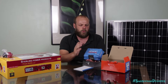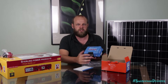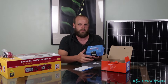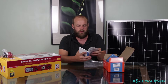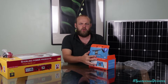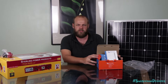There are many different brands online, and we'll put a link in the description to where we bought this from on eBay. The different lights on the front tell you the different modes the solar controller is in. Absorption mode means your battery is charging; float means it's just holding its charge and the solar controller is putting in just enough to replace what's going out of the battery. We're pretty pleased with the solar controller and looking forward to getting it all connected. This particular one comes with a five-year warranty — one of the reasons we went for it — which gives us a little extra peace of mind if anything goes wrong.